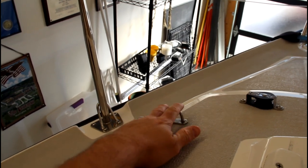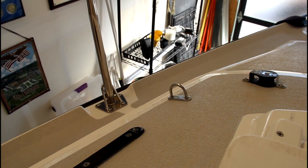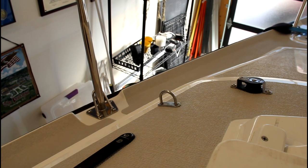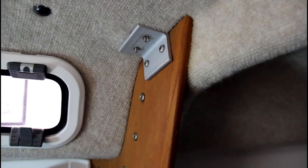In Precision boats with a PVC core, the damage you see from water intrusion is staining — staining in the headliner is usually your first sign, or drips of water, which is what I saw in my case. I was getting little drips of water below the chain plate and also near one of the stanchions, so I actually re-bedded both. This video covers what I did for the chain plate. The thing is loose, it wiggles, and I've been getting a little bit of water — usually just in the morning inside the cabin, just a couple drops on the cushions — but it's just going to get worse.